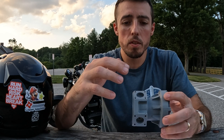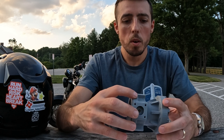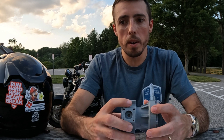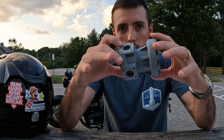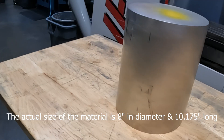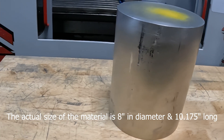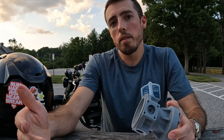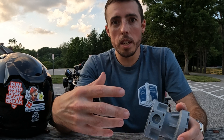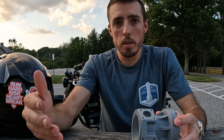If there's any internal processing such as laser marking or stamping, figure out roughly how long that's going to take and how much it's going to cost. Next is components — if your part is required to have helicoils, dowel pins, or any components added onto the part, get these quoted. For this part, the material is $217. I'm going to put a 15% markup on that material, because we're going to be doing a receiving inspection on it, we have that upfront cost, and we did the legwork on getting the quotes. Don't be afraid to mark up the material a little bit.